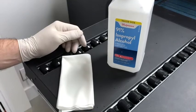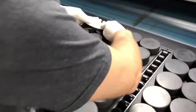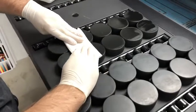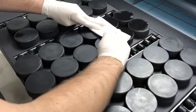The next couple of steps are critical to the printing process. First, we're going to take rubbing alcohol and wipe down the hockey pucks to ensure we remove all fingerprints, oils, grit and grime — anything that was received from the manufacturer. After that, we're going to apply a bonding agent to ensure that the ink sticks to the rubber.